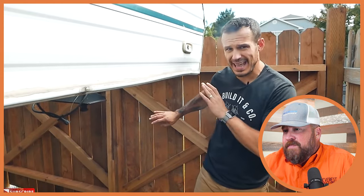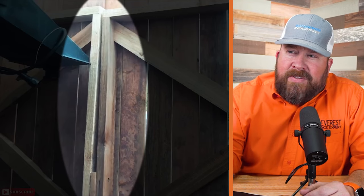The trailer fits perfectly in the side of his house and he couldn't be happier with how everything turned out. The gate looks and works fantastically, and the little added wheel at the bottom is a perfect addition for the sloped terrain. Probably what he's done is put the wheel there to support the gate with the unsupported post, hoping it won't pull it over as much. But wheels end up putting everything in a bind more often than they actually provide support. If we look at the beginning of the video, the unsupported gate has already fallen — we see a wider opening at the bottom than at the top and the top rails don't line up. I'm not sure he actually accomplished the task of a no-sag gate. Let me know what you guys think in the comments below, and what you may have done differently. I'm Joe Everest, the fence expert, reminding you that good fences make good neighbors — I'll see you next time.